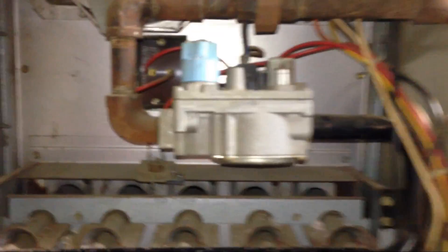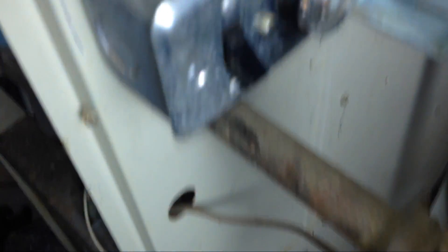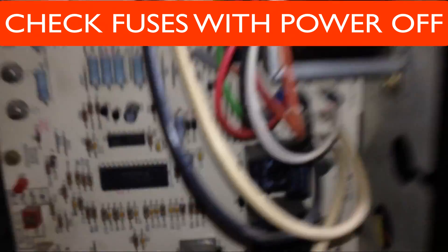I'm going to go ahead and run through this furnace now. It's been longer than five minutes so this is basically doing a reset. I'm going to turn on my gas and then flip on that starting switch. Now right here I want to show you there is a fuse. These don't usually blow, but mine's glass — I pulled that sucker out the other day and I got electrocuted. So make sure you're just touching the glass because that thing will shock you. There's also another fuse — you can see it's that purple one right there and that fuse is good. But if those fuses are popped, that's probably going to be your problem.